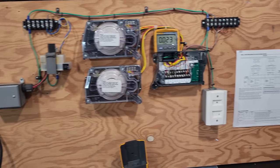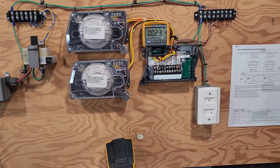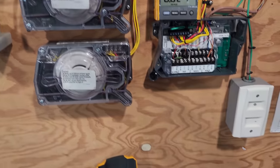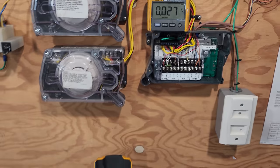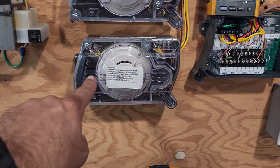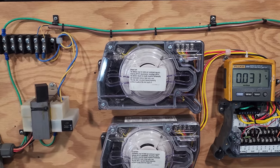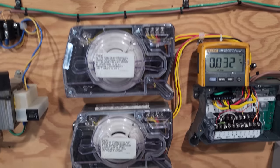I've got my duct detector trainer board here that I made a long time ago. The primary purpose of a duct smoke detector is simply to be mounted in the duct work. You have sampling tubes and exhaust tubes going into the duct work — there are two holes on the back, one for the sampling tube where air is forced in through the holes, comes through the detector head, and then exhausts back out into the airstream. This particular setup has one control module and two sensors.